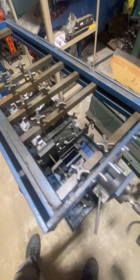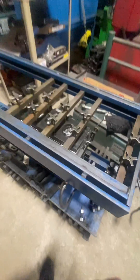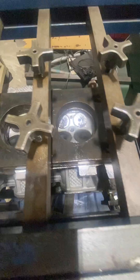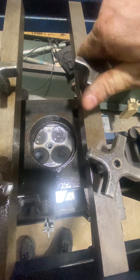I've got 40 pounds on the water jacket and it's in this PT38 pressure tester. It's a rollover fixture and you just take soapy water and spray the whole thing down. This is dish soap with water so it's very sudsy. If I loosen one of these up, it's clearly pressurized.